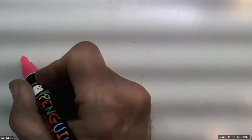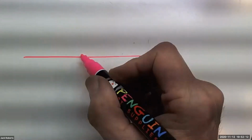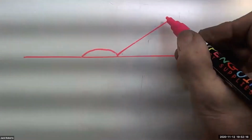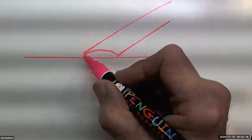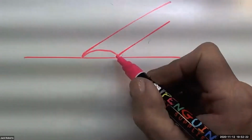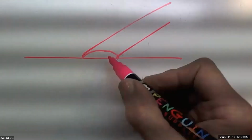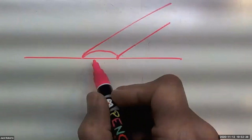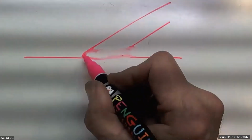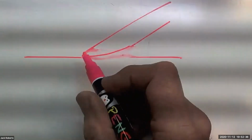So if you have a spindle here, and you're putting a hollow ground spindle gouge on it, and you want to bevel it, there it is. There's the tip cutting, okay? And there's where you're making contact. So there's where you're riding on a bevel. Now that changes a little bit because you're not going to turn it lengthwise, you're going to turn it on. The grind that I use makes the bevel closer to it, and so it's not quite as radical.